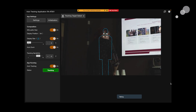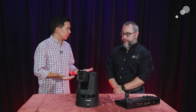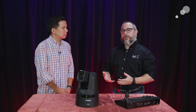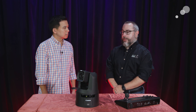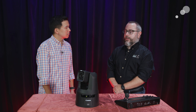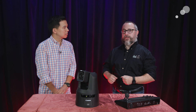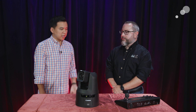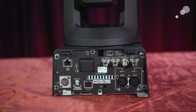We also like the fact that it introduces 4K60 output versus the 30. 4K60 is really great for live performances and sports. Having that higher frame rate is really beneficial for fast-moving objects, or if you're doing a concert where performers are running around a stage — really great for live performances, dance, things like that. And with that comes the 12G output, which is how we're able to get a single output on 4K60. But it still has a 3G output, which is nice.